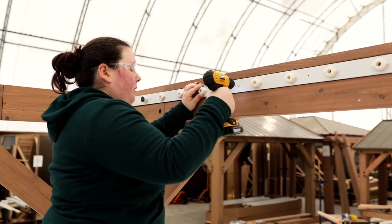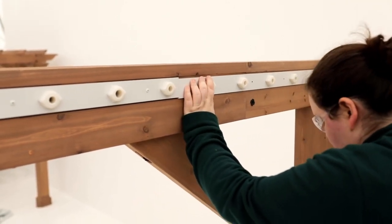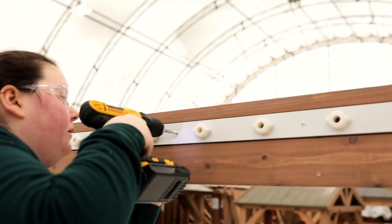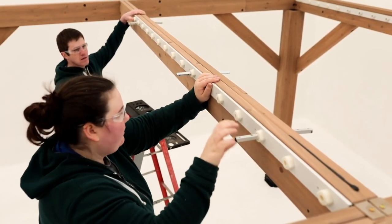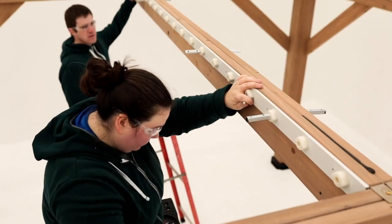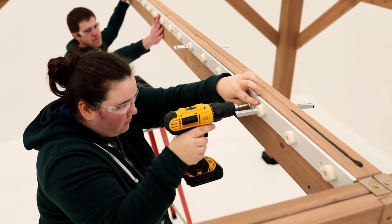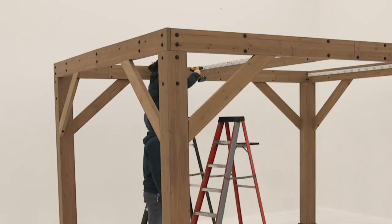Next, place a louvered rail assembly 826 tight to the end of the louvered rail assembly 2378.3, then attach with pan screws. Repeat this process for the other short beam assembly. For the middle beam assembly, place a louvered rail 2378.3 in the groove, making sure the bushings with the arrows on top slide over the three previously installed axle through pin shorts. When the louvered rail is in the correct position, attach with pan screws. Tight to the end of the louvered rail, place a louvered rail 826, then attach with pan screws. Repeat for the other side of the middle beam assembly.